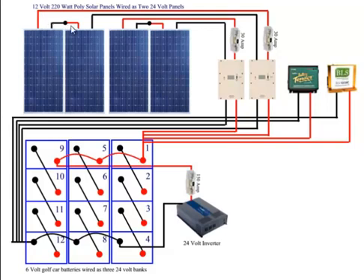I have the positive here, which is left over from connecting these two, and the negative, which is left over from connecting these two. I run those two positive and negative cables over here into my charge controller. Between the solar panel and the charge controller, I have a 30-amp fuse.